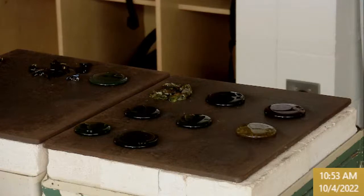A similar manufacturing process is used to produce other types of bottles and jars. In this run, the company is making 375 milliliter wine bottles out of clear glass. This run is producing bottles also out of clear glass. This mold, though, has a special feature, a recessed insignia on one of the walls, which produces a raised insignia on the front of the bottle.